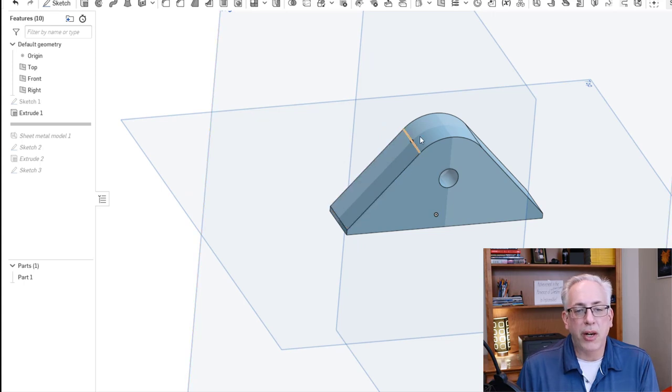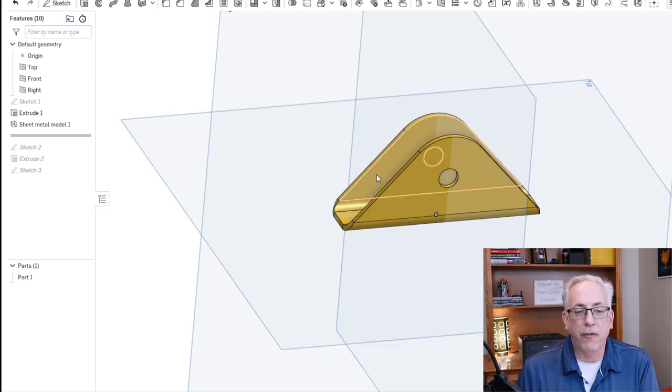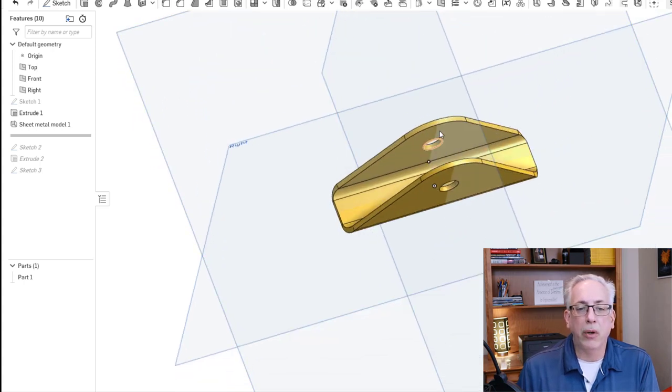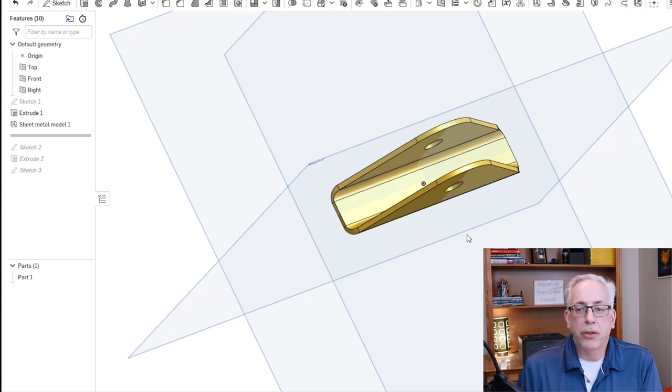And now you'll notice that there's a face here and a face here and a face here and a face there. And when you ask the computer now to make a sheet metal part, what it'll do is it'll put a face on every one of those. It'll create a thin sheet metal piece for each one of these faces. Hard to show that, but that's basically what happens there. But what you do is you go in, and if you remember the face here and the one on the top, you select those and you ask it to eliminate them. And so as you eliminate the pieces, anything that's left over, it puts the proper radiuses in for the bends, and then you tell it what the thickness of the material is, and ultimately you end up with a half inch in the middle here, which for the rod end bearing and the two AN964-16 washers, that makes the half inch piece.